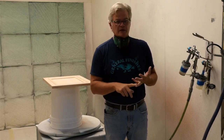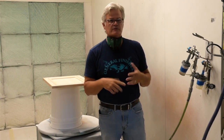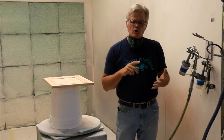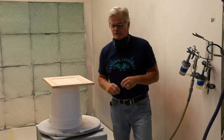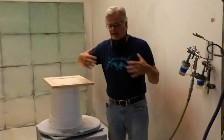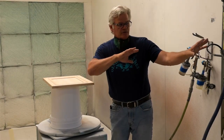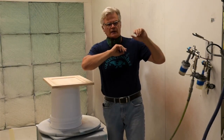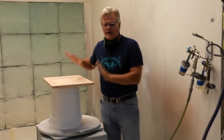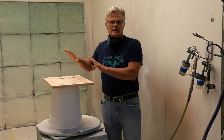And then the second question is sunlight. Are you talking about, is the piece that's been painted directly exposed to sunlight, like in a kitchen? It sounds like she's saying, can she do this process in the sunlight? I'm going to say that is not a good idea. Sorry for blowing that idea. Here's the reason why. I don't like painting. Let's just, for instance, today it's 92 degrees outside, beautiful sunny day. I understand why you'd want to work outside, but you're going to adversely affect how the products spray and level and dry.